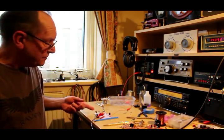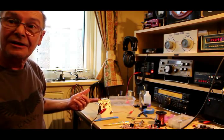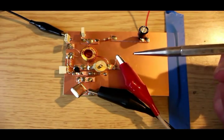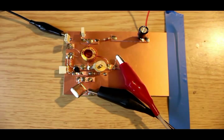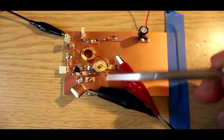Well, enough of pictures and diagrams. I built the crystal oscillator and it does work — that's when I thought I'd better make a video of it, because quite often the things I build don't work. Here it is, idling away. It's pretty stable. The reason it's stable is because it's a relatively unusual circuit recommended by Frank Harris — it's his favourite crystal oscillator circuit, known as a Butler oscillator, which I hadn't come across before. It has a number of features, stability being one of them.